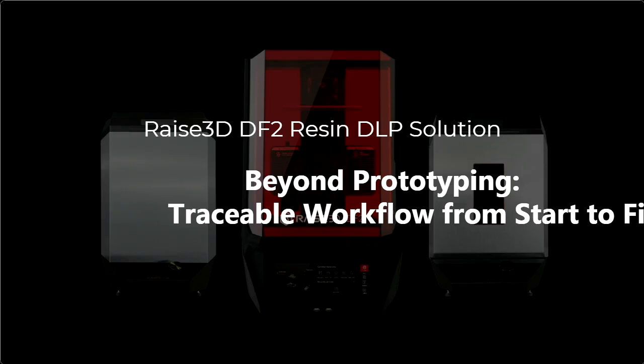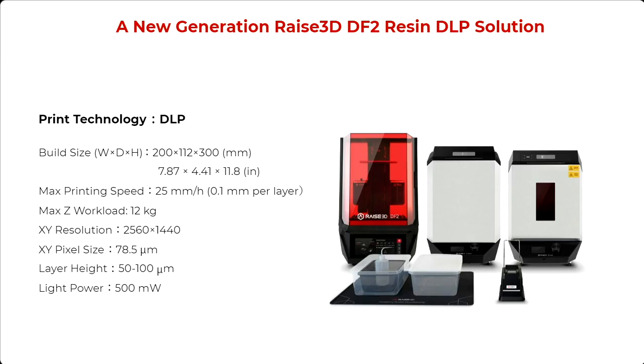So the DF2 resin system is, as you can see, beyond prototyping with traceable workflows from start to finish. I'll go into detail on the traceable workflow in a second, but a little bit of specs on the machine itself. The DF2 is a pretty decent sized machine, but I do want to point out this workload with the 12 kilograms. It's able to hold a good dense material and still produce accurate parts each time. So you are able to put a good amount of weight on that build plate that you see here and still have successful prints time and time again.